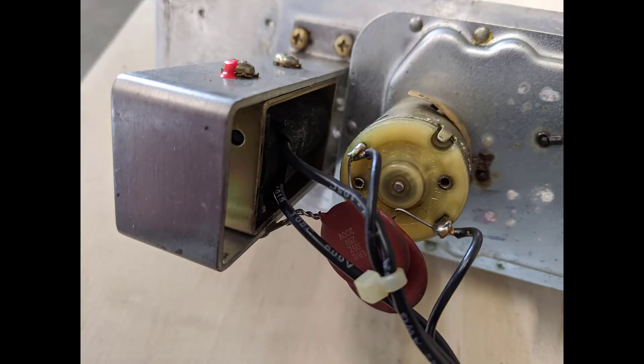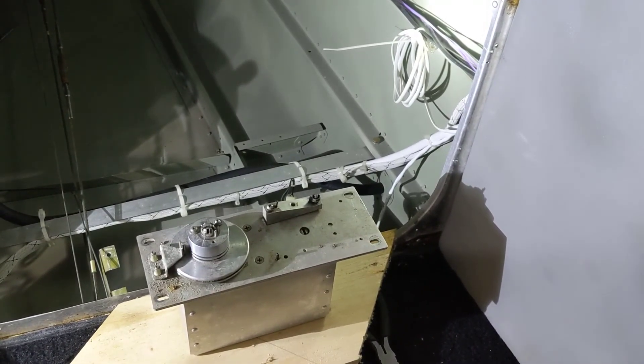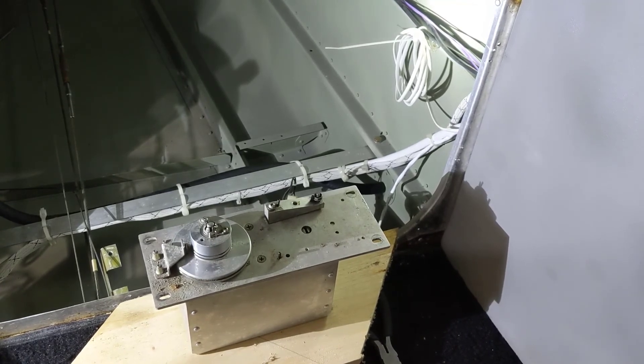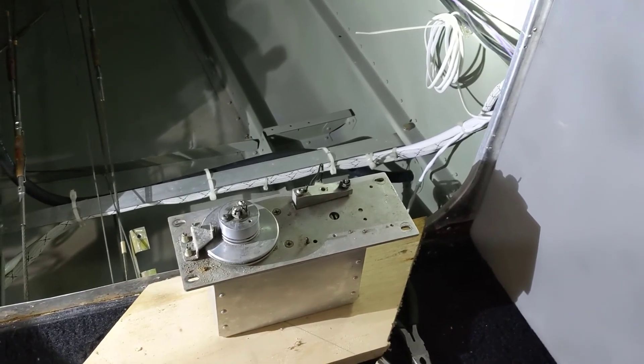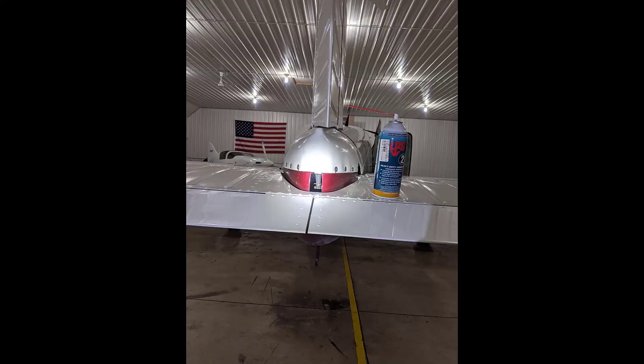On the left-hand side you can see the solenoid and the clutch, but in the middle there was a broken wire. That broken wire had to be fixed — that was the culprit, because it powers a little magnet piston in there that sucks down. I put some solder on there, put it back in the plane, and tested it. On the right side you can see that magnet piston: when you engage it, it sucks down and puts pressure on the clutch between the cork pad, which makes it turn.